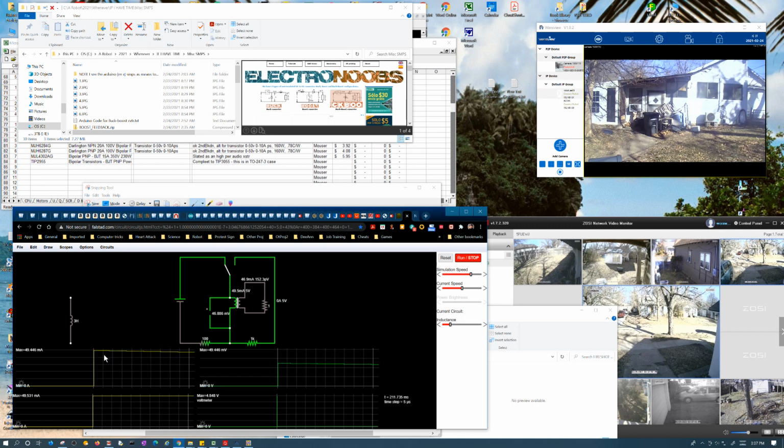But it's not getting 1% of the current, though. The current's being shared equally, interestingly enough. But the voltage, I don't know. Because even the voltage across our inductor has dropped to like 5 millivolts or 50 millivolts. Because we're almost fully charged all of a sudden, that's why. So again, it's behaving almost completely resistively.